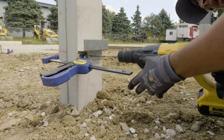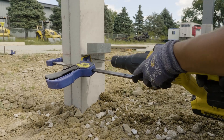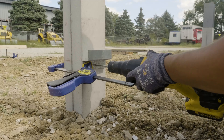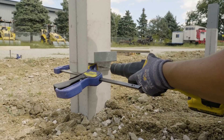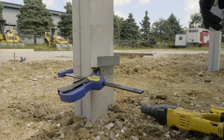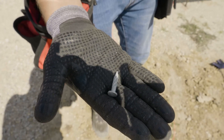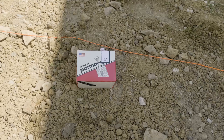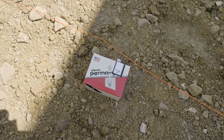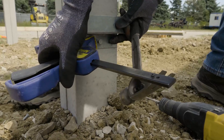There's a hole in the bottom of this bracket we're going to line up, start pre-drilling our hole there, and run it in at least the inch and a quarter required for these one-inch concrete nails. That's going to be the same fastener we're using in every other application for putting wood splash boards on these perma columns. We'll stick that right in the hole we just drilled, then take the clamp off.